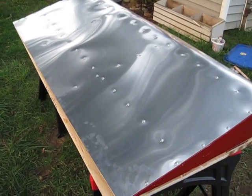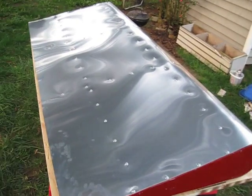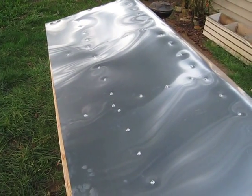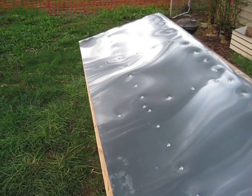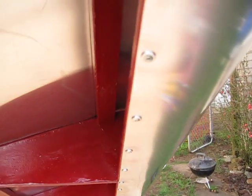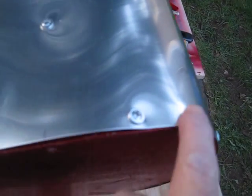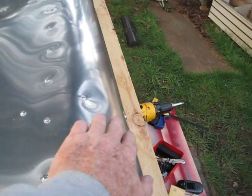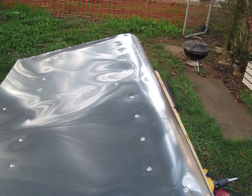Just got the sheet metal on one of the wings — it was quite a chore. I'm using 0.025 sheet metal from the same shop that did my machine work. I started on the back side here — this is the C rotor design that cuts the wind and catches it. I put this piece down, measured, and put screws every four inches, came up around one edge and went all the way down, squaring it out every four inches along each of the centerpieces to get it tight.